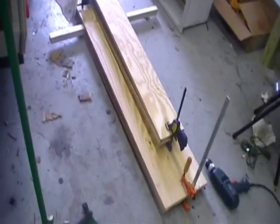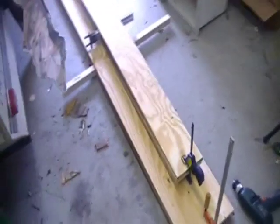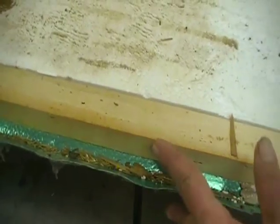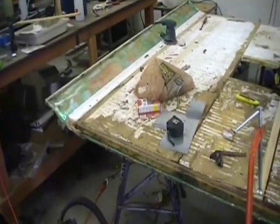Here's our plywood. We went to Home Depot and dug through 15 sheets and couldn't find one that was straight. So we've pre-cut the width of the pieces we need, and right now they're clamped and reverse bending so I can get four straight pieces out of it. When we put this back together, we're going to use wood glue, nail our sides back on, glue and clamp both end pieces, roll those up, and nail them in place.